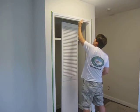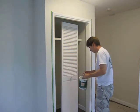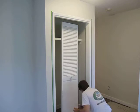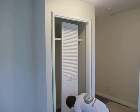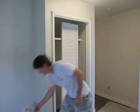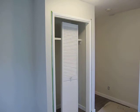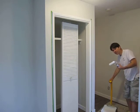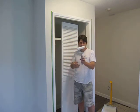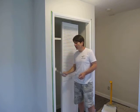See, I can go over this right now and it's not going to mess up the finish. For the flat area, I'm going to use a little mini roller. So it's all cut in now — I'm going to get a little tiny mini roller, a 5mm roller. This cage is from Wooster. Now, this is a very old house so it's been painted many times. It's got a bit of a texture on it, so even a 5mm is going to leave a bit of a texture. But this paint just rolls phenomenally well with the roller — incredible.